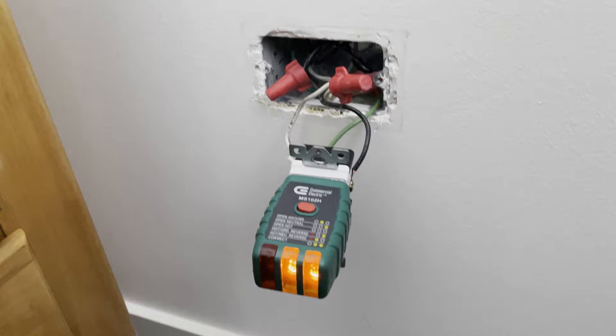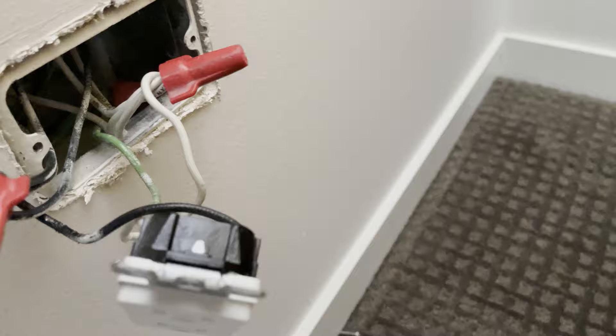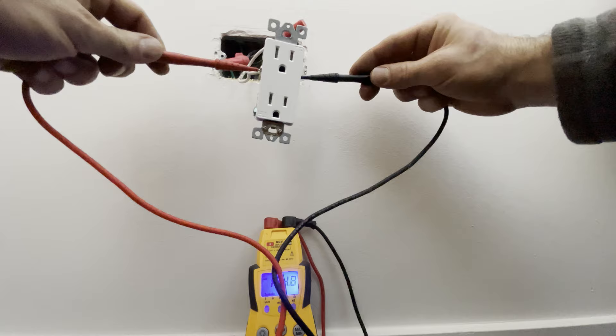So now we have power over here again. As you've seen, we had just a little over 100 volts earlier. I came over here, took this wire nut off, did a continuity check, and there was continuity — it's just that this wire nut was a tad bit loose. Now we have power throughout the room again, and if we check our voltage now: 124 volts.